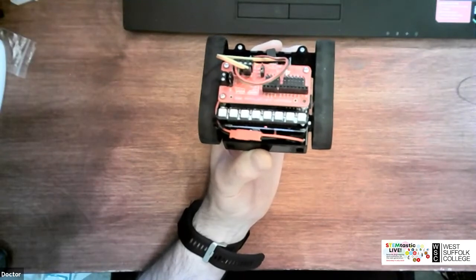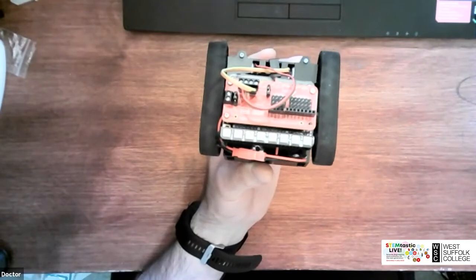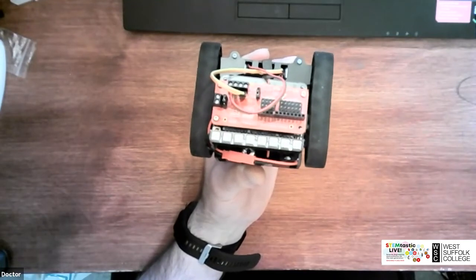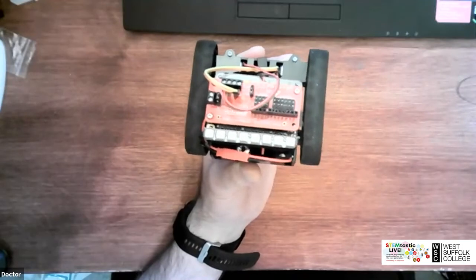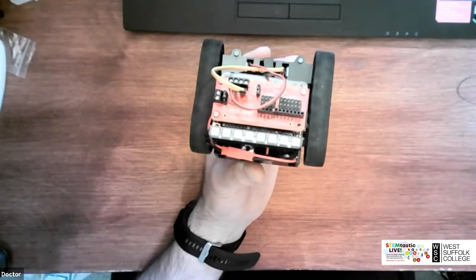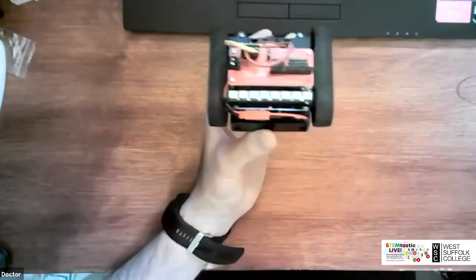I'll just disconnect from my Raspberry Pi. The Pinout website. I'm using a Pimoroni Blinkt, and I can see here that all it uses are the power, ground, and the data and clock pins. So just 4 pins. I'm also using a board, the PiCon Zero by 4tronix. There it is, PiCon Zero. I can see the PiCon Zero uses pin 38 and it uses pins 2 and 3. So there's no overlap, which means I know it's safe to put both of these boards onto the same Pi.